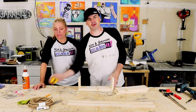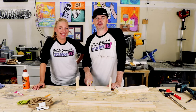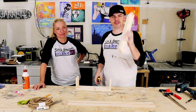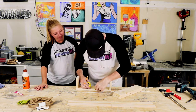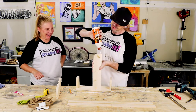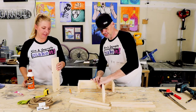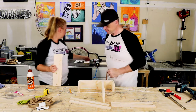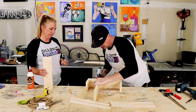Now we're going to measure in 3 and 11 sixteenths — it's a crazy precise measurement — to the center of these two 13-inch boards where we're going to place them. We'll glue these and place the center of the board right in there, making sure it's centered on both sides.